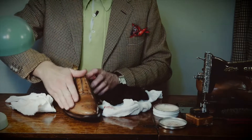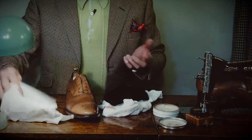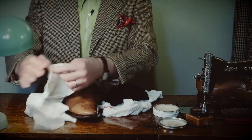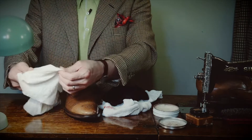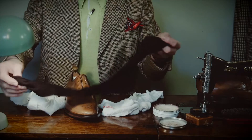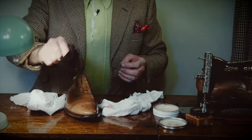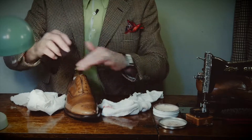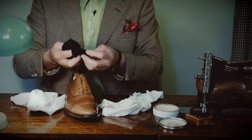To give a very nice smooth finish, you've got to use an extremely soft cloth. This piece of cloth is a very old bed sheet that's been washed, worn, boiled, and tumble-dried — it's very, very soft. It had actually started to rot a little bit, so I've torn it up and that makes a beautiful polishing cloth. And this is an old silk sock — a lovely fabric, but even silk is actually slightly too coarse and abrasive to give a really polished finish. The fabric just isn't fine enough.